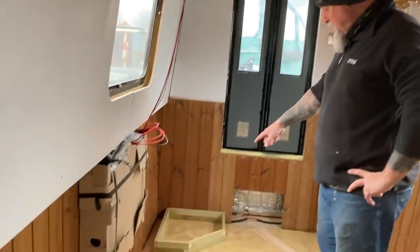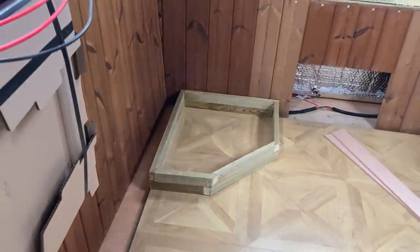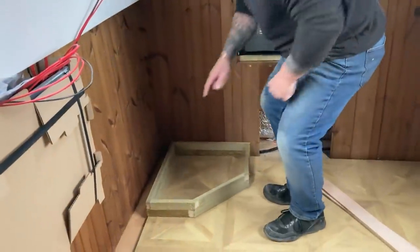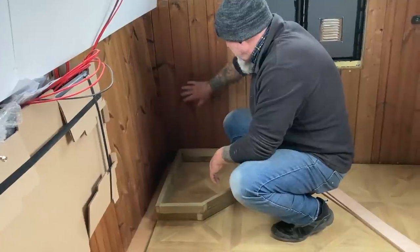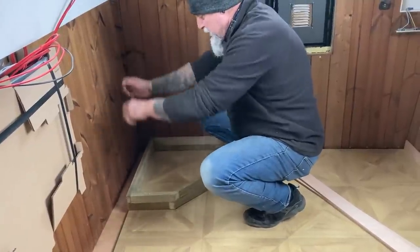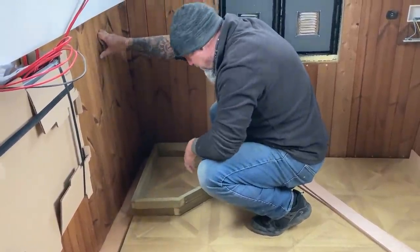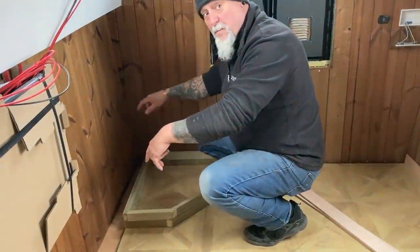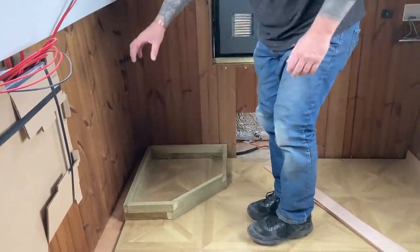I've just knocked up that frame. If you remember before, the plinth was stacked up on bricks. My idea is — I've got much more work to do in this area — but if I can get the hose that's the right temperature to go out of the water jacket into this cavity here, there's plenty of room, top and bottom. So a loop of hose out, and put my connections here for our central heating, so there'll be no joins hidden — no water joins, elbows or anything anywhere. That's the plan — that's what that channel is behind there.